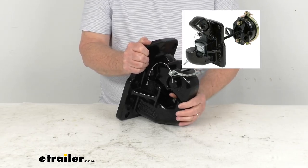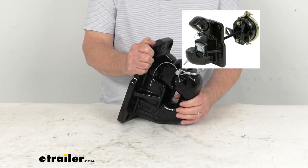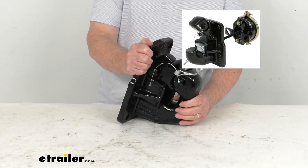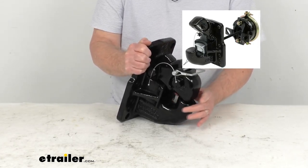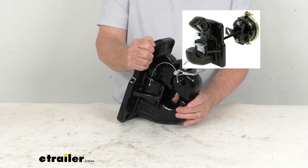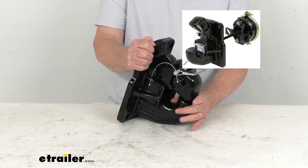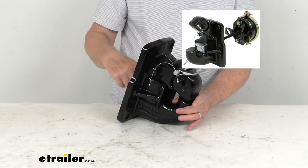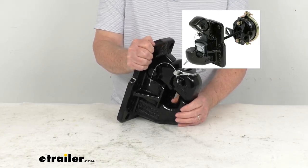When using those parts, this air compensated Pinto hook will cushion the movement between the Pinto hook and your lunette ring. When you install your lunette ring on here, this feature will save wear and tear on the parts, especially in sudden motion or braking situations. The Pinto hook will use the air system to hold that draw bar eye closely to reduce wear, absorb shock, and prevent uncoupling during operation.